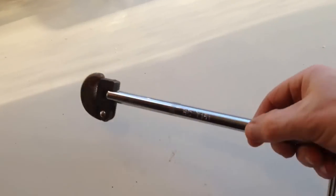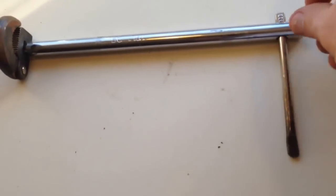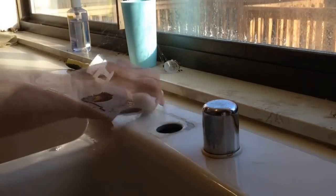Next, I'm going to go up to the top and loosen the faucet itself. There are two nuts holding the faucet on, and I can actually reach them with the wrench. Once I get that, I can loosen by hand, then go to the other side and loosen that nut — it's just the nut holding the faucet down to the sink. Now, if you can't reach it, you may have to use what's called a basin wrench, which extends your reach. It has a jaw on the front that grips the nut, bends to one side or the other, and you just twist it on the nut if you can't reach with a regular wrench. So now that I've got it loose, I can pull out the faucet and the supply lines, working them out. They're staggered, so they do come out.